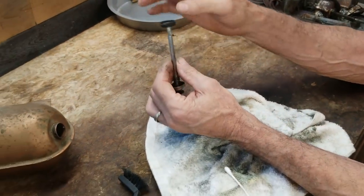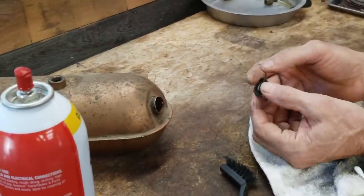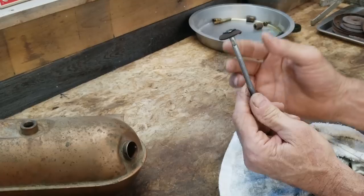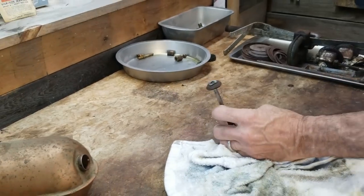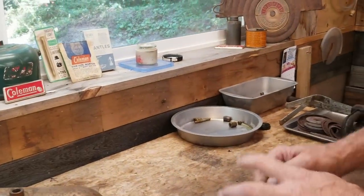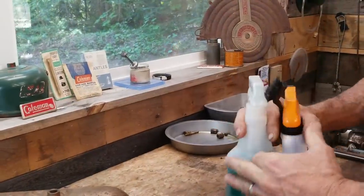Next we have to deal with the leather cup and this is an old one. It's still nice and soft, but being form-fitted inside of that cylinder in this position for so many years, it needs to open back up. What you do is just open it up like an umbrella. Then you're going to soak it in Neats foot oil. If you've never heard of Neats foot oil but you played baseball, you probably know it as glove oil. You can also use sewing machine oil — any light oil will work. I'm just going to set my Neats foot oil up in the window, put it in there like an umbrella, and let it soak.